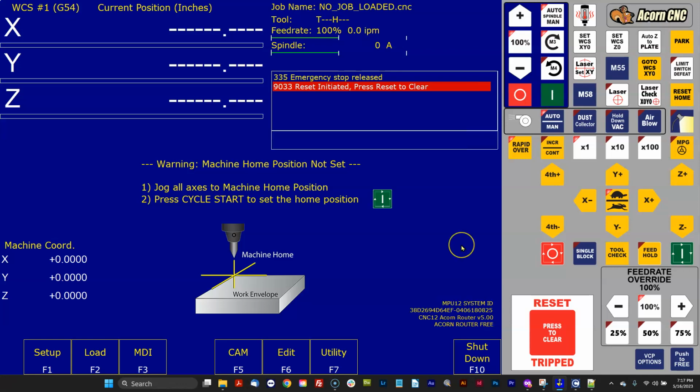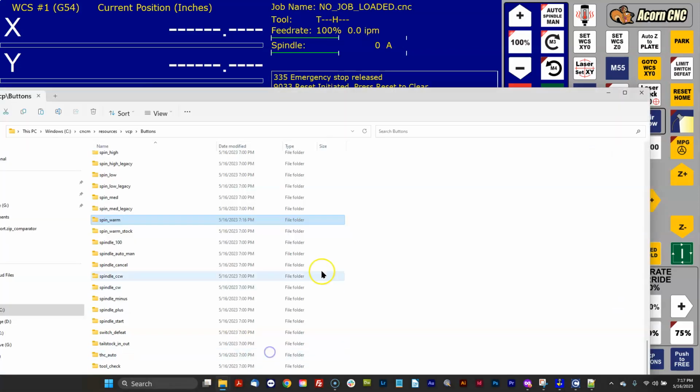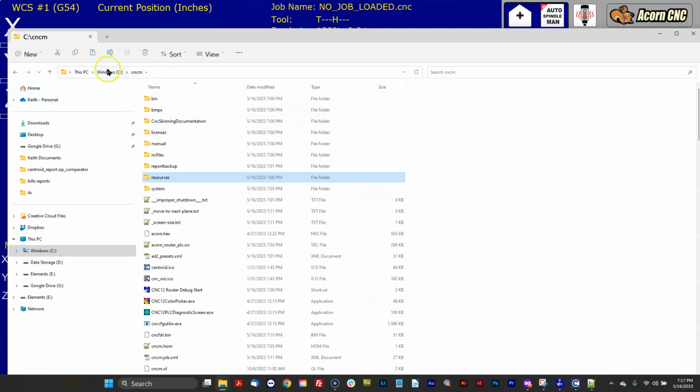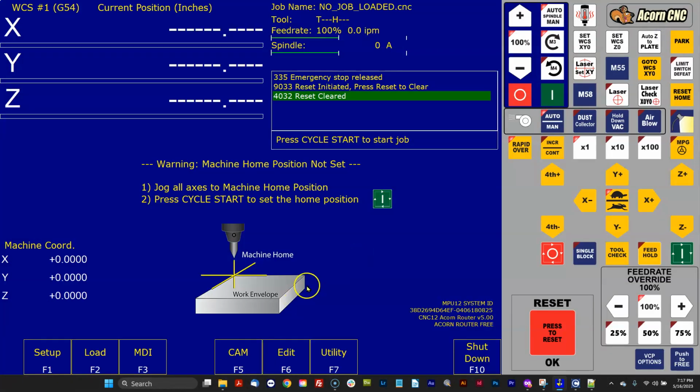Hopefully in the next version, we're going to add a feature called Import Report into the wizard, and it's going to ask you a bunch of questions and do the bulk of this type of work for you. But for now, that's in general the process of getting over your files from the old install to the new. One last one I just want to mention, license files the same way. You could reinstall your license file, or you can actually go find the license file in the old 482 directory. It's license.dat.